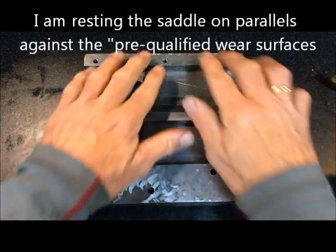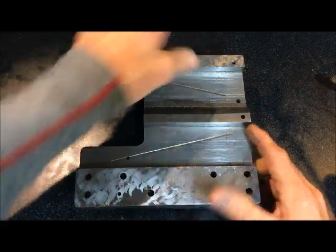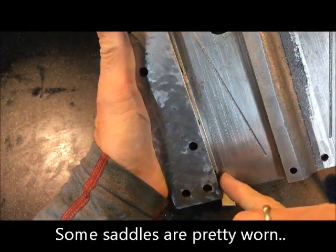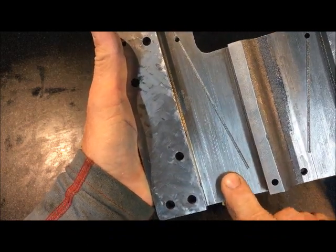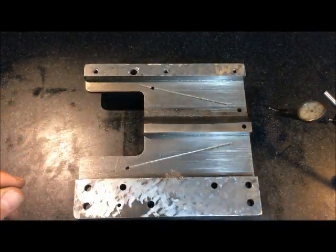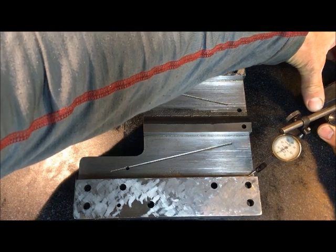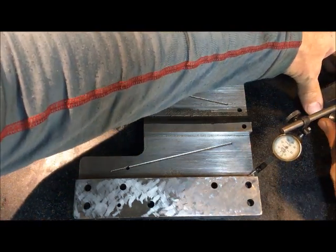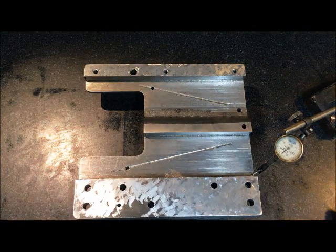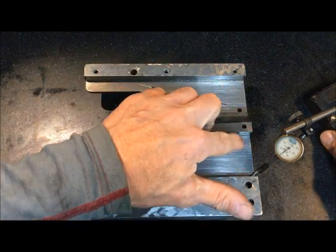The top is now also scraped and I have what remains here — the surface is quite worn actually. There is a ridge here that represents the surface that is worn and the pristine area, which I'm going to use to locate and measure the wear. So I'm zeroing the indicator here at the unworn area. Now this is the front, to the operator, so here I would expect most wear.